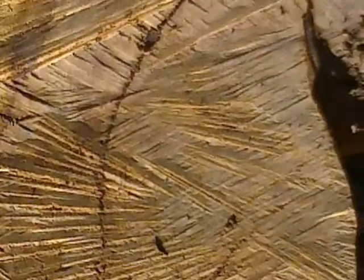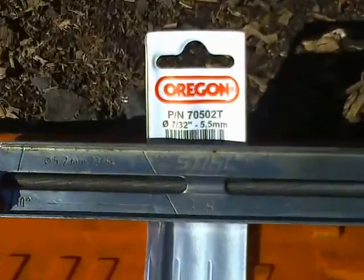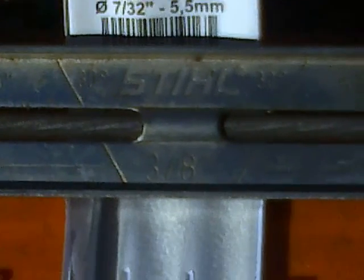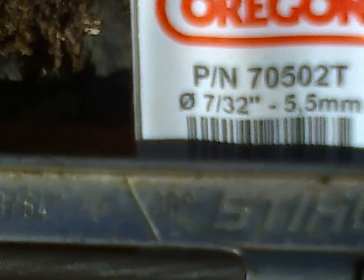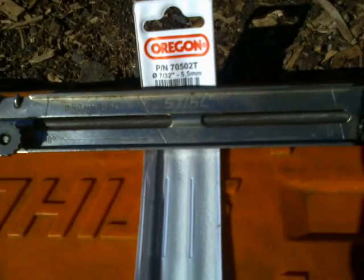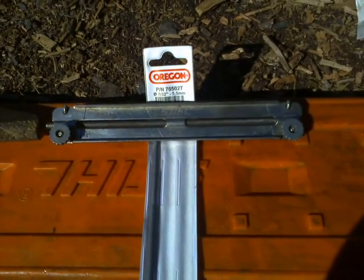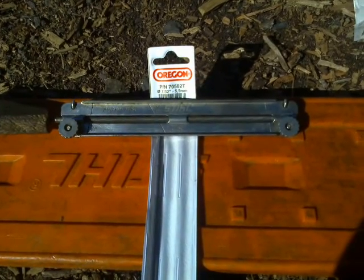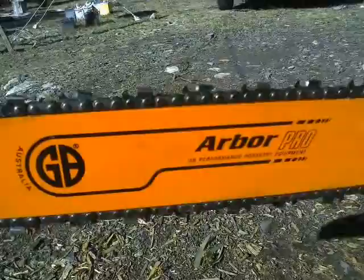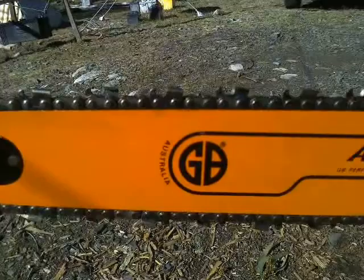Causing me to polish my way through the log. And it turns out that this is how you achieve such a disastrous result. The file is 7/32 — 5.5 millimetres — but the file guide is for a 3.8, and it's supposed to have a 5.2 millimetre file, 13/64 of an inch, not 7/32 of an inch. So the file guide is just a little bit too small for the file. I'm assuming this file guide came into my toolkit when my son bought his 029 Stihl. So I had the wrong chain on the right bar, I had the right file for the wrong chain, but I had the right file in the wrong file guide. And it only took me 4 years to figure it out.